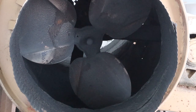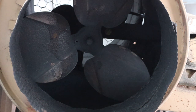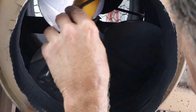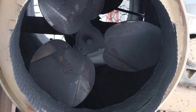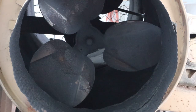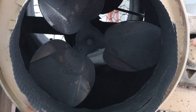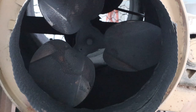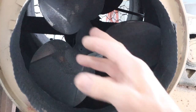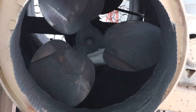The shaft runs down there and there's a small pulley — looks like about a two-inch diameter pulley. I have it overdriven so the motor spins slower than the shaft. I've got that adjustable pulley set so it's a lot bigger, overdriving this. So if the motor's running at 1700 RPM, this thing's running at least two grand. It does a pretty good job.